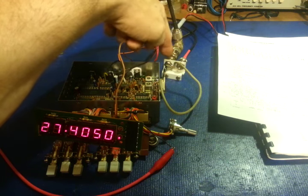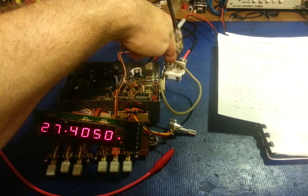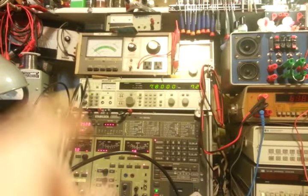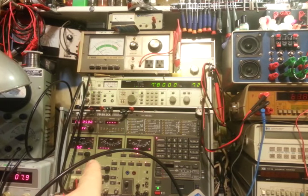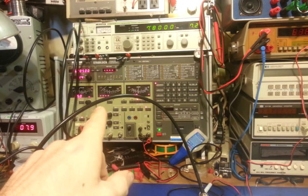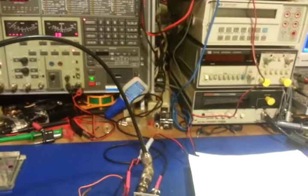So I just have that hooked up to a little block here with two BNC headers on it, and then it's run out to two separate signal generators. So the signal generator up there is supplying the 7.8 megahertz, and then the signal generator in the communications test set right there is currently supplying a 35.205 megahertz signal. So if we actually look, get the camera repositioned here,